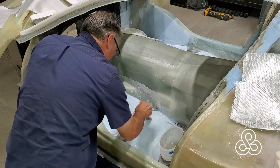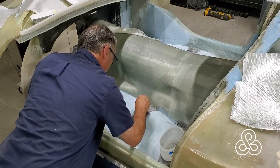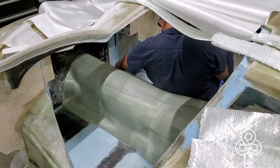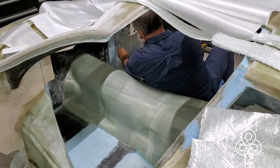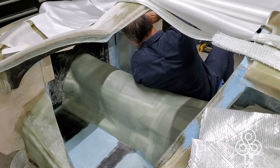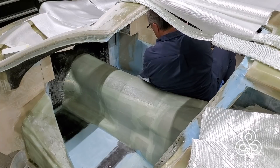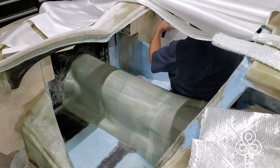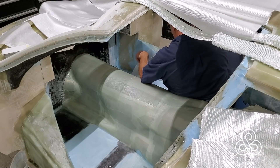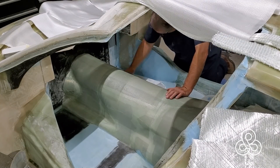This is going to take two sections to go all the way across the floor — a front section and then the back section. Then I will switch and go back and put one more layer on that vertical area in the footwell and then do another layer on the floor. All I need is just two layers to create this foundational surface for our real buildup that we'll be doing in another video. Of course doing the same thing on the opposite side — put our layers into that vertical area in the footwell, and we'll just keep working that down to cover anything that has never received any fiberglass yet. Some areas I trimmed off and coated with our slurry, and we'll get them all encapsulated with our first layer of fiberglass. Then we will do the vertical layer, do our floor, go back and do the vertical layer once more, and then another layer on the floor. You'll also notice that I do a fairly aggressive lap on the joints.